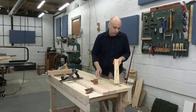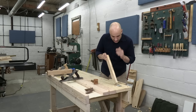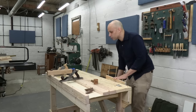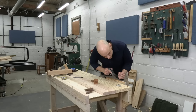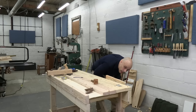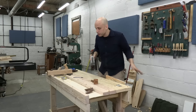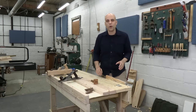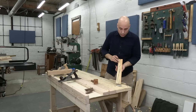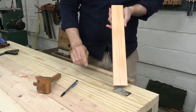I rotate the piece and come cleanly off the edge. As I'm looking I see I've got a tiny bit of layout line in the last four inches of this edge — that's not the edge I was registering against, so it hasn't thrown my project off. But now's a good time to go in and make that final adjustment. Don't be afraid to go back and adjust your work; it's okay. Now I'm going to mark that rip line with pencil.